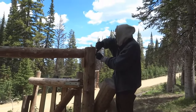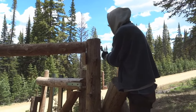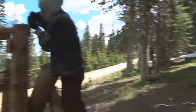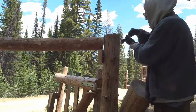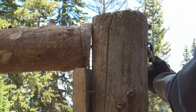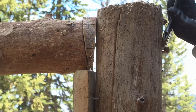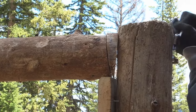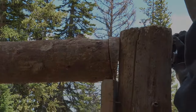That's the crossbar in place. I've done about three quarters of it and Mike's just finishing it off, giving it the final few turns. We had to use a manual auger to make the hole because the power drill is out of action — battery's flat. If I zoom in right there you can see where the bolt comes clean through. I'll be filling that with wood filler so there's no more gap. The bolt is going about three to four inches into the actual cross piece, and that should hold.